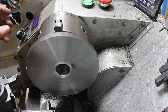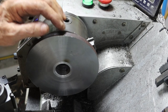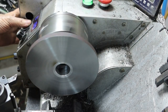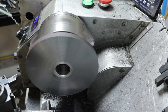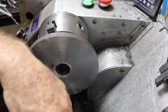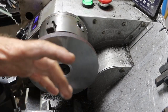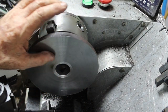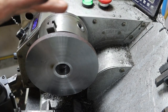I'm glad I turned the camera off — that took bloody forever. Eventually I got it reasonable and put three spots of weld in the back to hold it in place. Don't look at the outside, it's running out a bit. But the inside's not too bad, so I'll make the arbor up, attach this to the arbor, and when I know it's nice and true I'll just take another light face off there. I might finish welding the back before doing that in case it warps any.